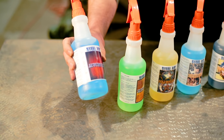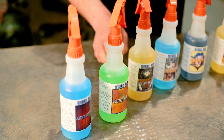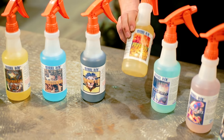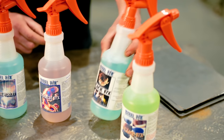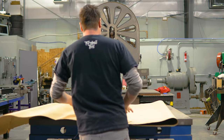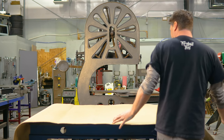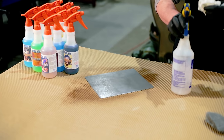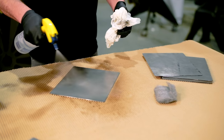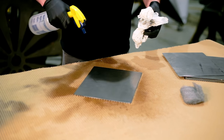So let's do some sampling on these big pieces of cold roll plate. This one will change the metal auburn, this one will turn it rusty gold, you have copper, bronze, pewter, blue halo, torch, black, and flame. The first thing we need to do to get this patina applied is get the plate really clean. I'm going to use acetone to wipe all the oils off on both sides. If it's not clean then the patina won't work that well.